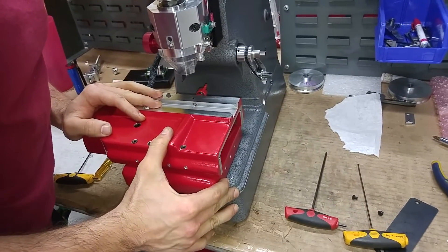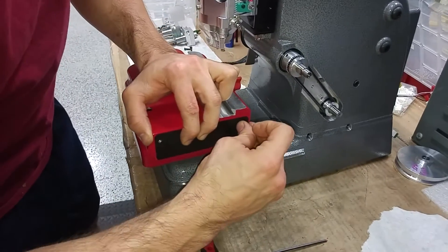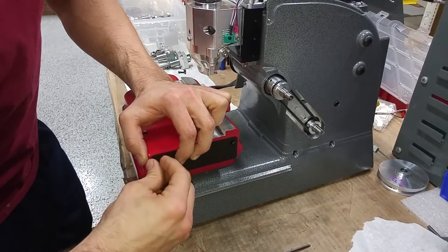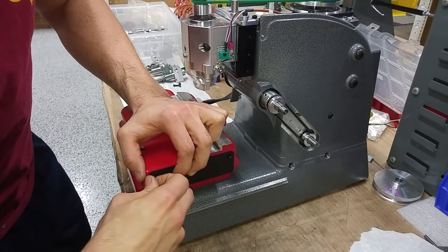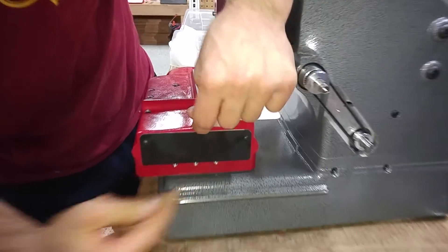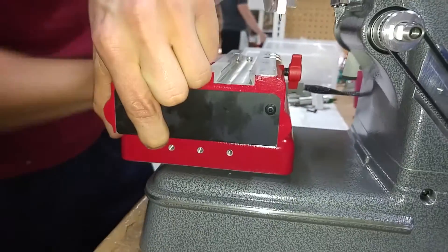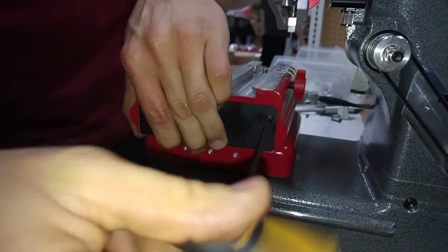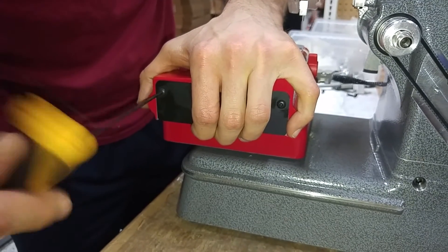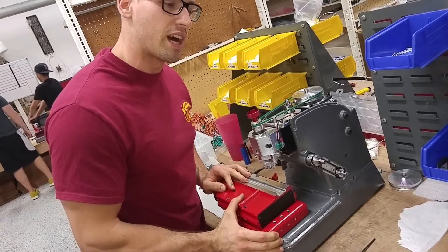Be careful again about how quickly you move the table — very slowly — make sure you make your way all the way back to the end. We're going to put our end cap on. Put your screws in by hand to start with. Make sure the end cap is seated all the way at the top — we want to eliminate any gap you see here because it will allow this to sit too low. Push it all the way up from the bottom, and as you're pushing up tighten your screws down. Then hopefully you'll be able to pull your table over nice and slowly, all the way to the end, giving your machine now full travel.